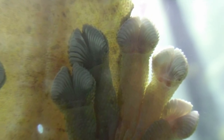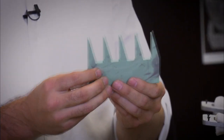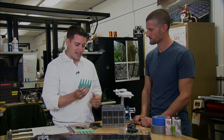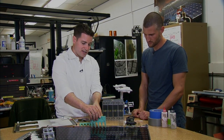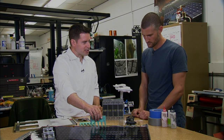So how do you actually mimic a gecko's foot? We make synthetic gecko adhesives. This is our design — it's 2,000 times the real scale. These hairs are actually much smaller than the hair on your head. You can turn the stickiness on and off depending on how you load it. If you just come into contact, this is the non-sticky state — you don't have very high real area of contact, not much van der Waals force, so it doesn't stick.